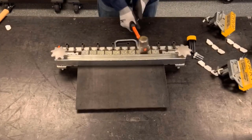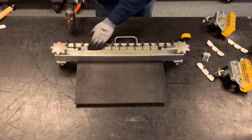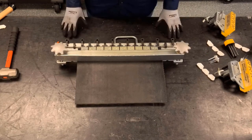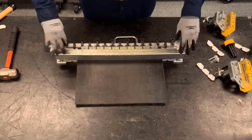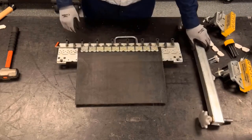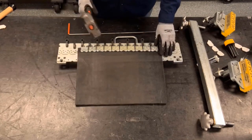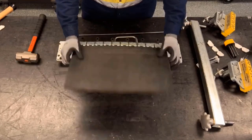And then I'll go and hit that scalloped edge. And now the final set is complete. Now we can remove the belt end from the tool. We're going to loosen up the clamp bar and take it off. Then we're going to remove the gauge pin. Sometimes the belt end is tight coming out of the MSRT. You can take your hammer and hit the belt edge right in front of the MSRT, and that'll help lift it up out.